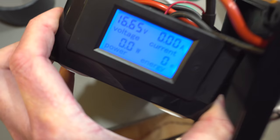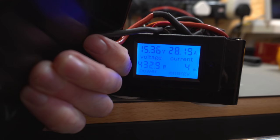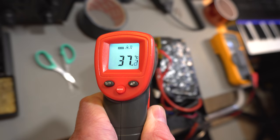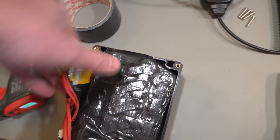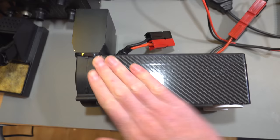It's not the neatest thing in the world but I managed to sandwich it all back in the box. So let's plug in the heater — right, that's going. We've got about 30 amps going out there, which is what the BMS is rated for. Don't know if it's continuous though, we'll soon find out. 432 watts — lovely amount of heat coming out of there. Let me check the temperature — it's getting warm, hotter down one end but I reckon that'll be okay. We could always add some ventilation holes.